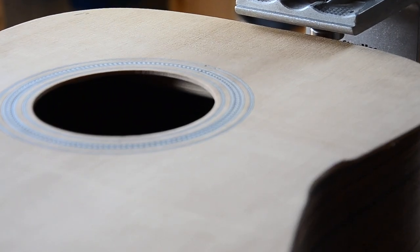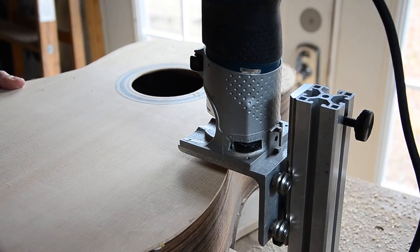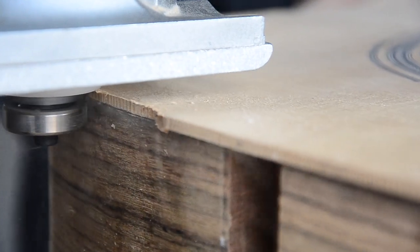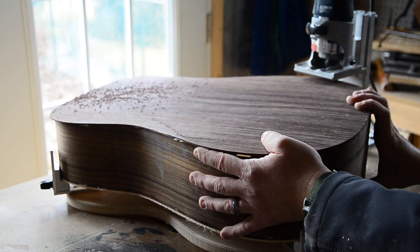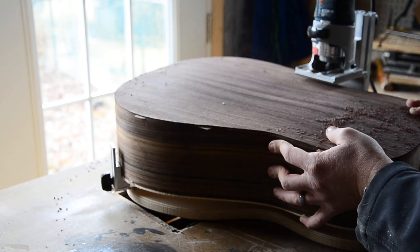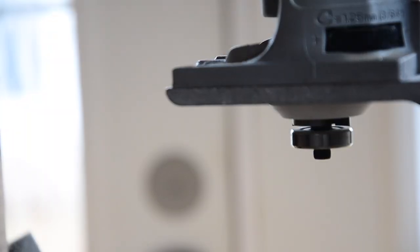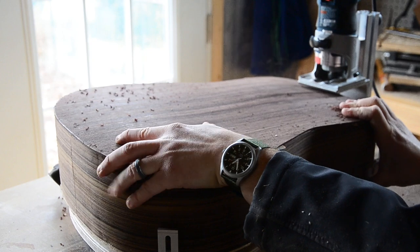Routers are wonderful, but they're very powerful and they can ruin months of work in fractions of a second. Initially I didn't want to spend the money buying a routing jig like this one, but after putting so much work into this guitar, it felt like it was worth it — and boy, was I right. In my opinion, this is the only way to go. The way it works is this cup-shaped piece rides along the top of the guitar, allowing the router to move up and down on its axis to follow the contour of the sides, while the mount prevents it from tilting. This was worth every penny and I would highly recommend the StewMac version or this equally great model made by Blues Creek Guitar. As an aside, I'm not in any way sponsored by StewMac. I have a lot of good things to say about them because they've treated me very well and I like their products. They are expensive, but you get what you pay for. I actually had a piece of this jig break because I dropped it and StewMac sent me a replacement part right away at no charge. Using this jig really made the process easy and I'm so glad I decided to do it that way.